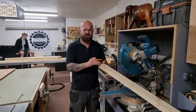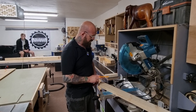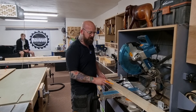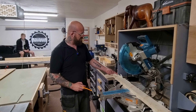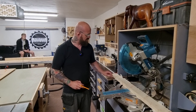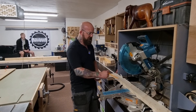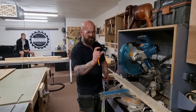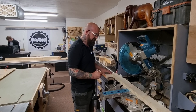These are all planed up, got all the rounded edges off — took quite a long while actually, filled a full bag up. I'm going to cut these at 360 millimetres long. I'm using my stop block here which doesn't come up close enough for short things, so I need to put a little extension in. When we add the top on as well, it's going to be quite a tall bench, but I want that because I want to put at least one shoe rack in there.